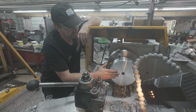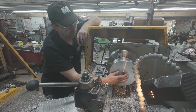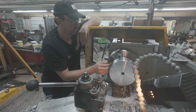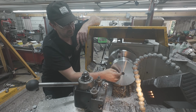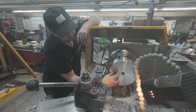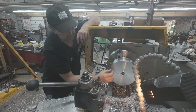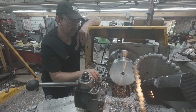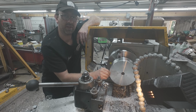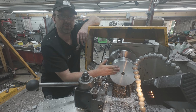All right, so for this end of the piston, we're gonna leave the center protrude all the way because we want as much as possible to grab the rod, especially when we get the taper. But we're gonna come in somewhere about here to there, and we're gonna cut a nice deep radius in there, probably go 3/4, maybe a little deeper than that, just for the steam space.